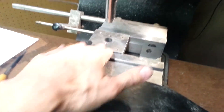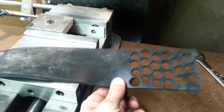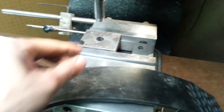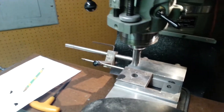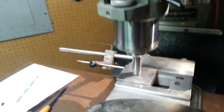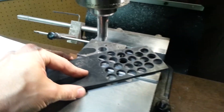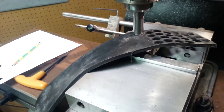Long story short, I made up a punch here. I got a piece of quarter-inch Buna 60 rubber, machined a 5/8" hole in this steel plate, put a couple thousandths clearance on the punch, and I have them lined up in the machine with the punch in the quill. They're pretty easy to punch out — you just line them up and pull down on the quill without too much effort and it just pops out.